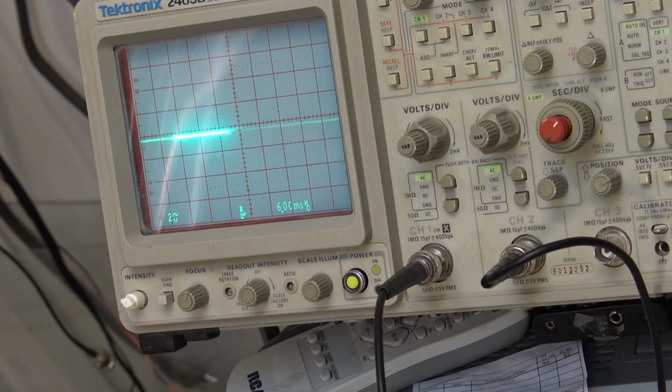so, what have we learned here about Class D amplifiers? Give them more voltage. Yes, a lot of them will say they'll run at 12 volts, they'll run at 5 volts, they'll run at 6 volts. Yeah, they will. They'll run fine, but you won't get your power. If the amplifier is rated at 24 volts, use an old laptop power supply at 19 volts. That'll give you almost the maximum power that the chip is going to give you, and they'll actually sound not bad, very respectable.